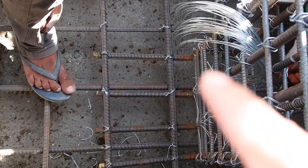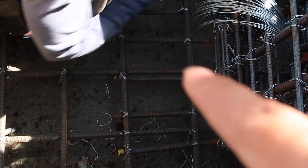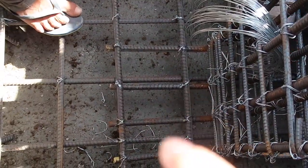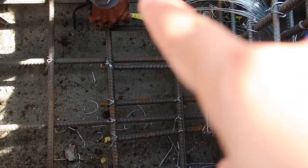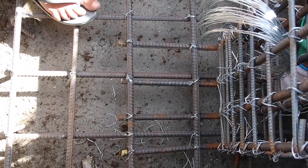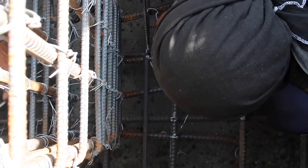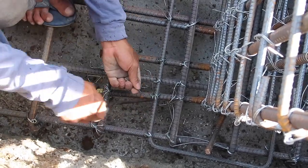They tied the bottom feet of the column, and then they will weld a 12mm rebar across — and then the other side too. This is the only column they're doing this on, and then the rest will be over the top. They did the U-shape of the 12mm around it — I don't know if you guys can see it but that's what they're doing, the 12mm over the top of the leg.